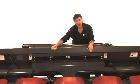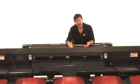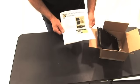Also included in the kit is a hood. Very simply, 4 bolts that attach to the corn head. It's there to restrict any ear loss in case the feeder house is backfeeding. Now let's take a look at what you're going to get in the dry corn kit.